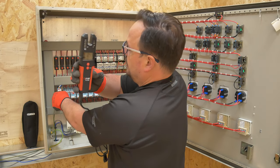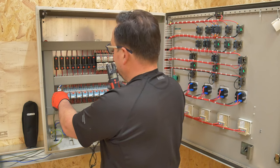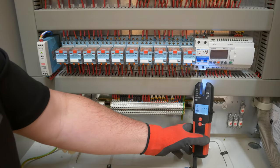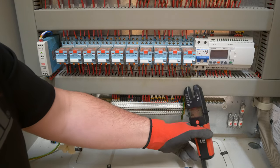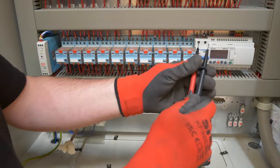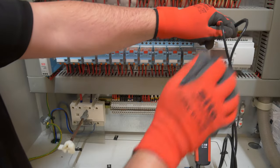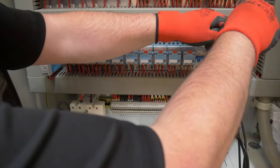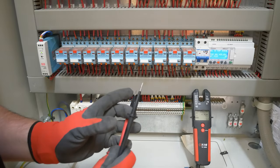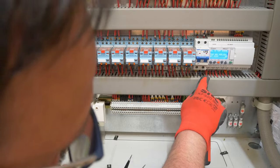If we go on to the output of the DC power pack you can see I'm measuring 24 volts DC - it's not getting too upset about that, there's no beeping or audible alarm, it's just giving me a voltage measurement. If we have a look at this 24-volt DC relay at the board here, I'll use the GS38 probes to get into these terminals as they're a little bit deeper. Although it's only 24 volts we don't want any flashes or bangs. We can see in there we have got 24 volts on the outputs of that DC relay, which is what we'd expect and want to see.